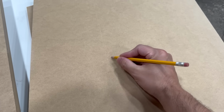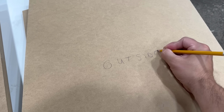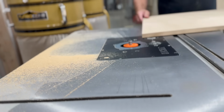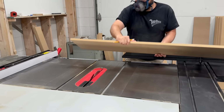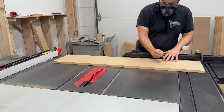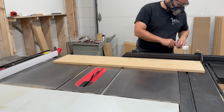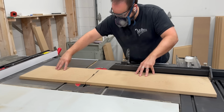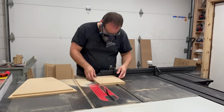This posed a challenge because our current tweeters that we carry don't really have enough sensitivity to keep up with this, especially after you start to add shaping circuits, because that can reduce the output a little bit just to match up in the crossover. So the next thought was, why not a 2.5 way? Well, when you've got parallel groups of 3, this becomes really challenging. If we had parallel groups of 2, this would be something that's possible. That effectively left me with a design using a tweeter that we don't carry and some other mid-range driver.